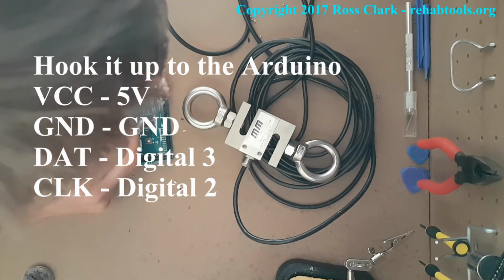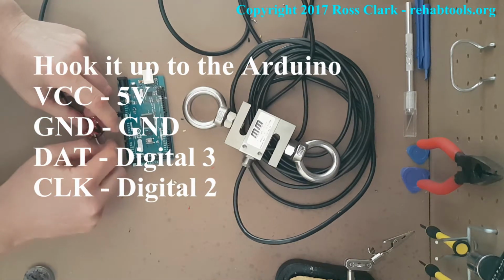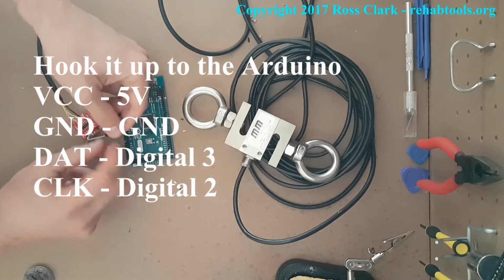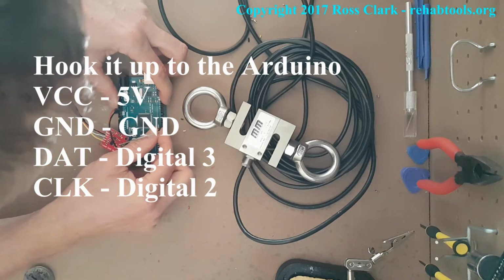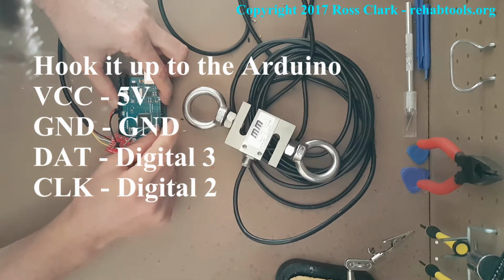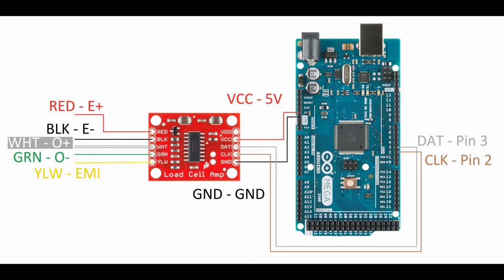Then we go data to digital pin 3. So that's the sort of, in this example, it's sort of a whitey, that one there. It just has a grey line on it, but it's white. So that goes to digital pin 3. And then clock, CLK, goes to digital pin 2. So really, really straightforward. And that's it. It's wired up. So that's the circuit diagram there. You can see the different wiring that needs to be done. Very straightforward. And now it's ready to plug into your computer and actually collect some data from. All right, good luck with it.